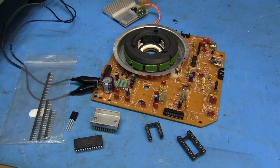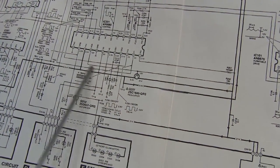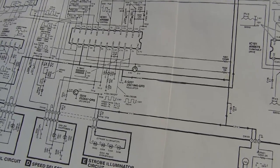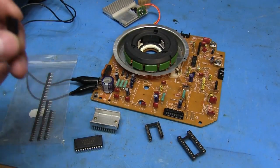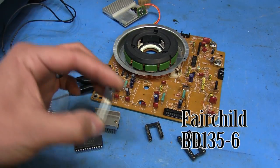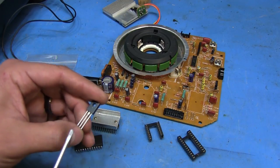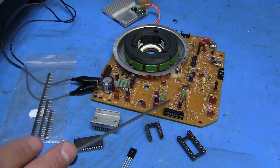According to the schematic, both pin 10 and 9 go to the transistor, which was originally a 2SC1846. That was a Panasonic part number that's apparently no longer being made, and I couldn't find any available anywhere. So I ended up resorting to this BD-135-6, which is actually made by Fairchild. According to the specs, it looks pretty similar - it's not exactly identical, but I think it's only being used as a pass transistor.